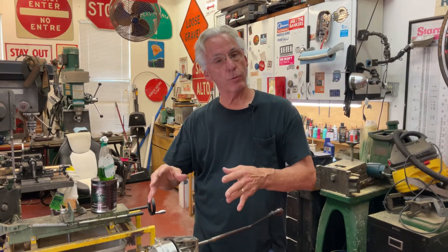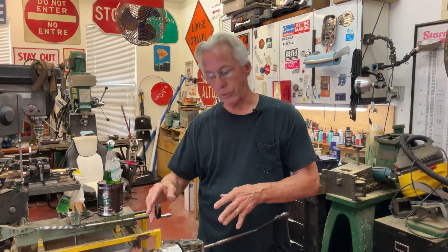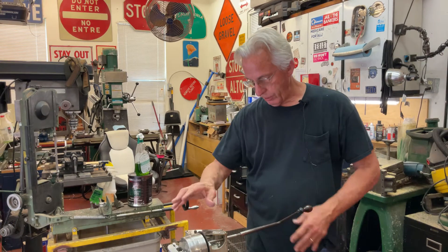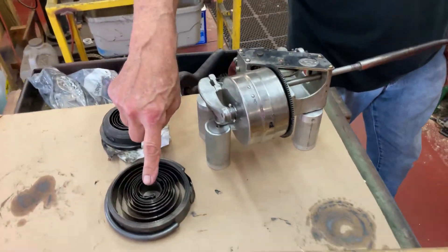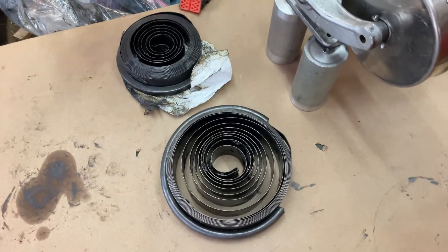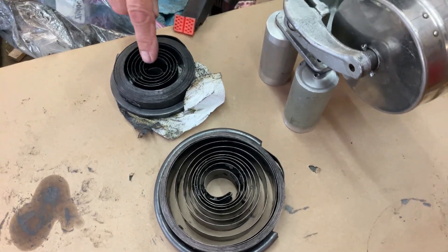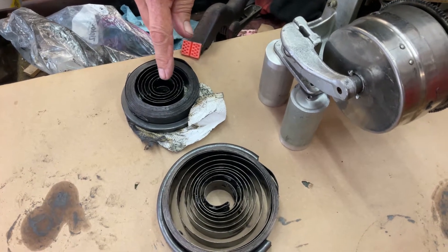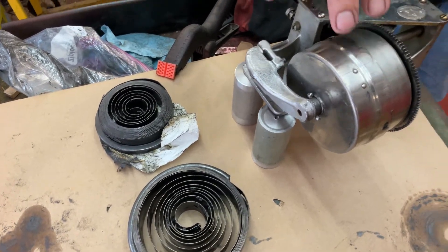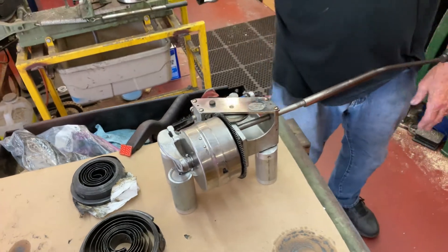The cost of the rebuild is always the labor plus parts. Like this Sonora here — the springs were in backwards, and you can see this. This one had collapsed too, so you replace both of them. If you bend this back in and try to hook it up, these will eventually break down the road. So we had to put two springs in, an arbor, and everything.